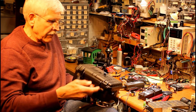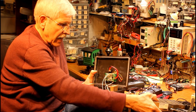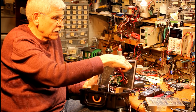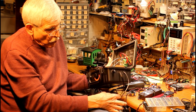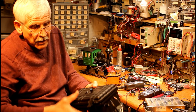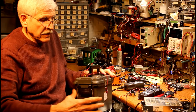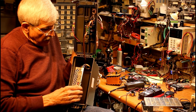Here's a box I picked up at Harbor Freight — meant to be a case for a camera. Inside, I have one of these power supplies sitting in the bottom, a power controller attached to the top with some Velcro, the double pole double throw switch that reverses, the potentiometer for speed, and I've added a fuse — explained in detail on my webpage — and a power cord. The power cord goes out to the wall, and these wires go to your track. I've got forward, reverse, and speed. This case was about $10 on sale. Here's another case from the same day — on sale for about six bucks, a plastic ammo box — with the same components inside: power controller, double pole double throw switch, and the power supply.